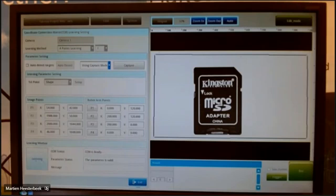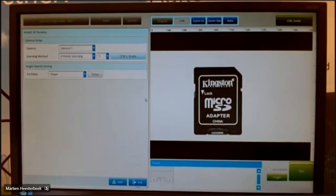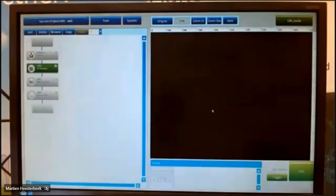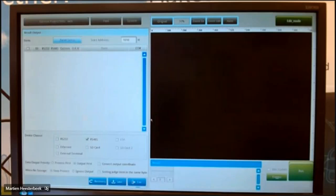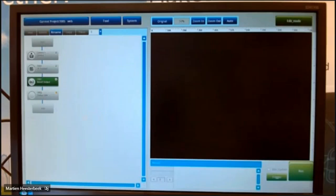That means these coordinates are now available in the system. Be aware, the camera is giving only pixels out, and the robot needs, of course, coordinates. So this one is now set up, and you can give it out automatically with RS232 to your robot itself. So that is the function one pole position, which can be used in combination with a robot.